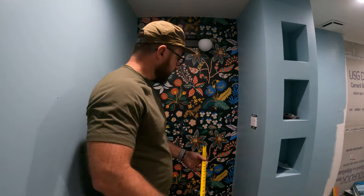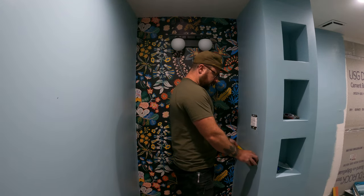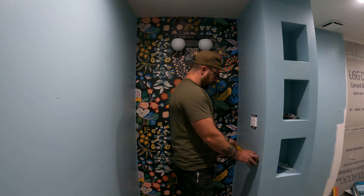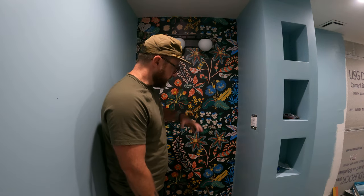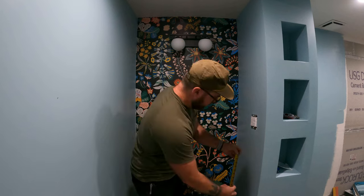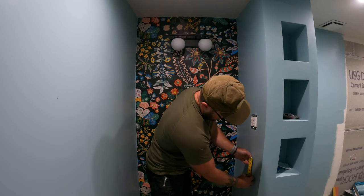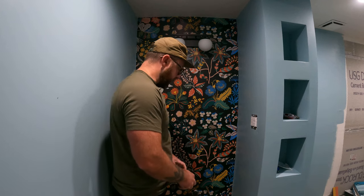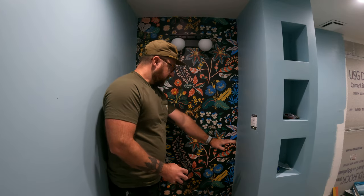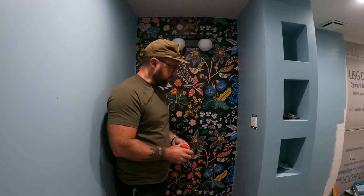The other thing we need to measure is how deep we want to go. The sink itself is nine and a half inches deep, so I'm going to go 18 inches deep because the faucet will have to be behind it and I want some extra room around the sink. We'll talk about the waterfall piece, which is going to be about five inches. We'll have to cut everything to 36 and a half inches wide, and I'll show you how to cut the waterfall effect on my table saw. Let's hop into the garage and talk about all the supplies needed.